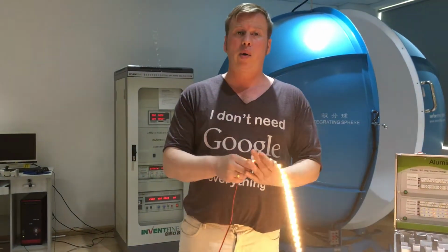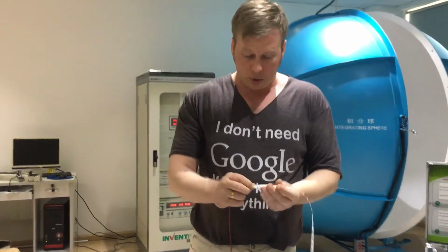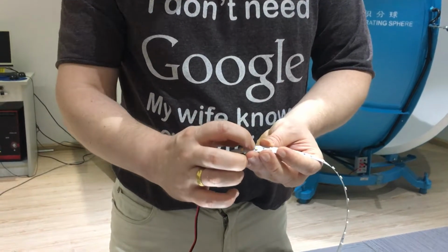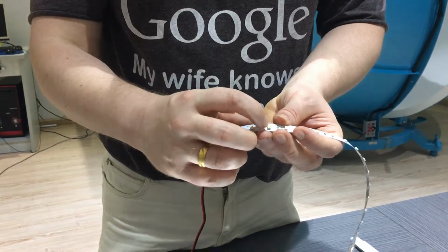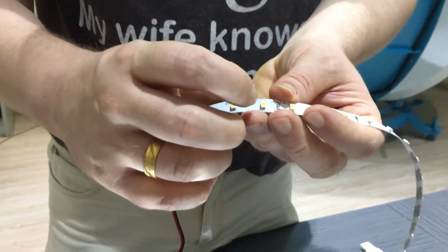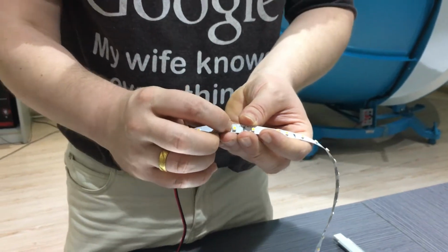on the diode. Now, when I actually switch off now, just to show you the LED diodes and explain, I'll just unplug this. Obviously you've got LED diodes. Now this one is a non-IP rated version. These diodes come in various formats. With an LED diode, you can get two types. You can get a gold wire bonded and an aluminium wire bonded. They need two wires to connect between the die itself and the negative plus sides. Gold wire has a better heat resistance and a better fluctuation on the heat, so it's less prone to fail.